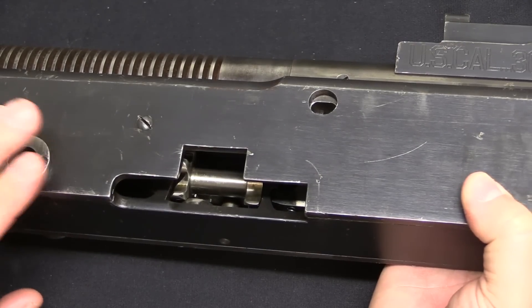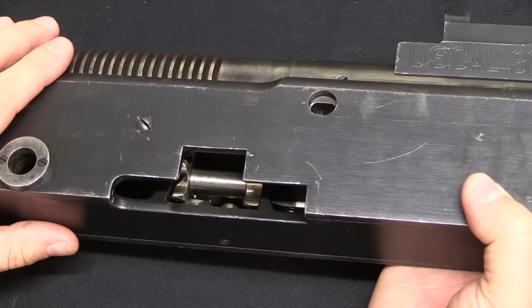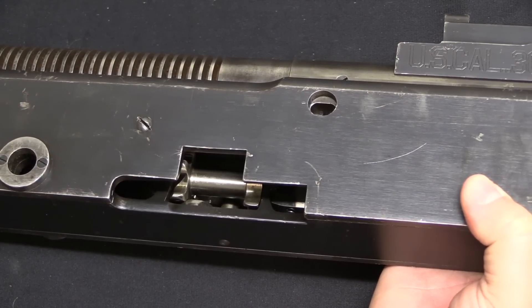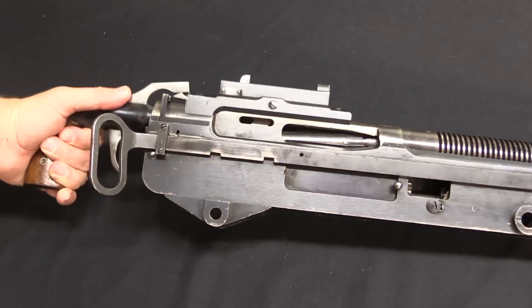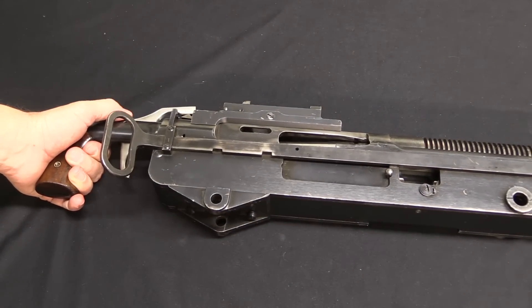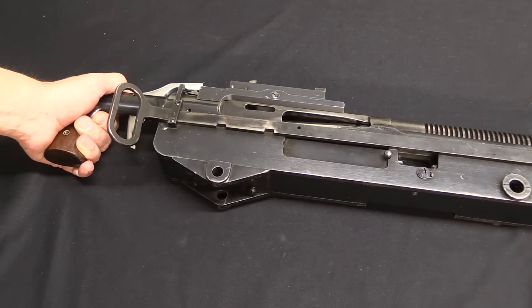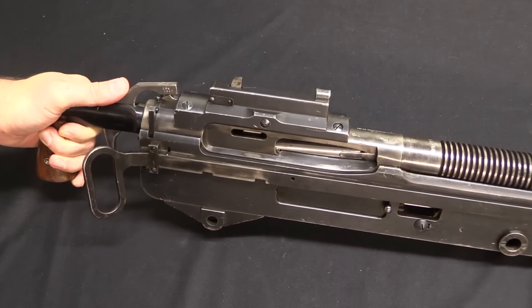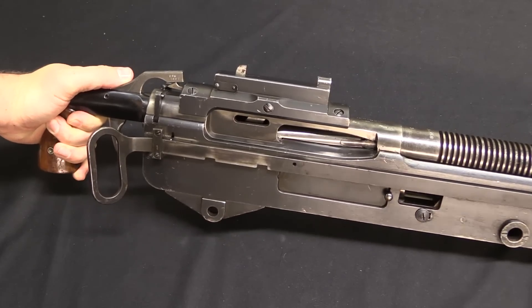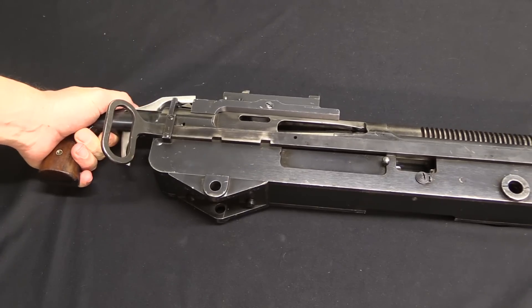Original Colt and Digger belts are quite hard to find, so if you get them, treat them well. Some people can get reasonably good feeding with later pattern Browning belts, especially if they're a little older and have stretched a bit, but they're not going to be 100% reliable. After implementing changes to the extractor and increasing the weight of the gas piston — also in conjunction with the fact that the Air Service always had the best quality ammunition, because in a dogfight you really don't want to be clearing a malfunction — these ended up being actually very popular aircraft guns for American fliers, and many thousands of them were ordered, installed, and used in American aircraft.